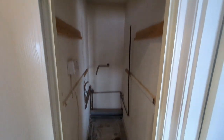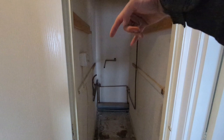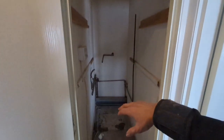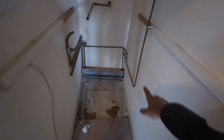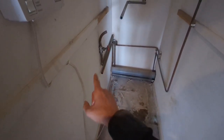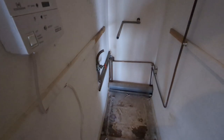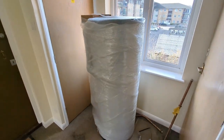The cylinder and storage tank are out — it was pretty easy because the frame the cold water storage tank was sitting on was separate, just bolted down. Once drained we slid the whole thing off, the cylinder came out, and the frame slid out too. We've now got the cold mains coming in, cold to the bathroom, and hot to the property. Once the thermal store is in we're going to upsize to 22mm, fit a scale reducer, tee into the cylinder, carry on to the cold for the rest of the flat, and the hot will come off from there. We've got the new one upstairs already — just need to unpackage it, get it in position, and start mocking up the pipework.